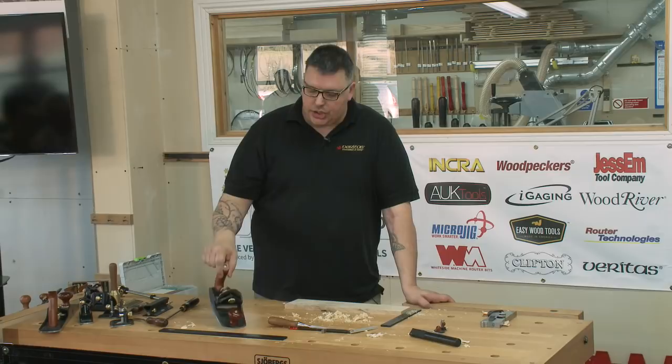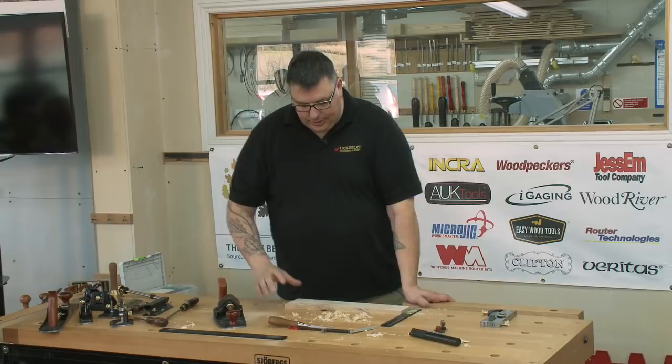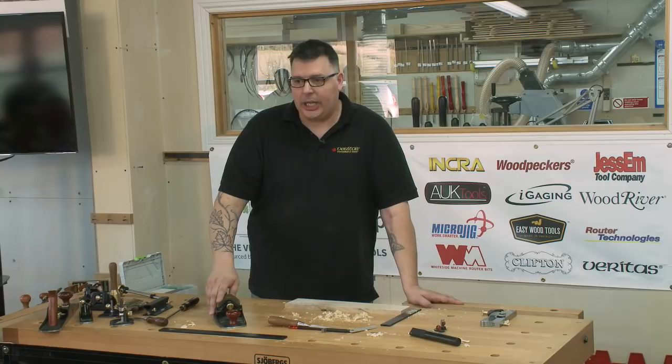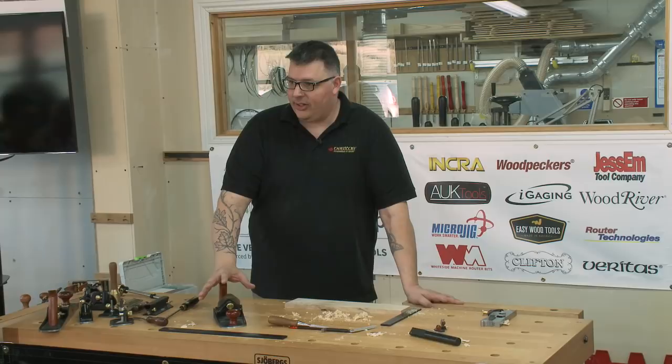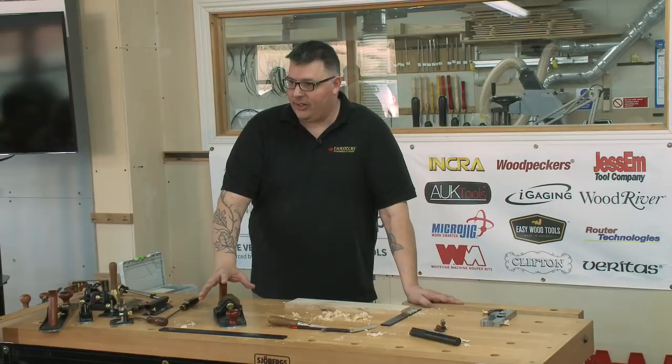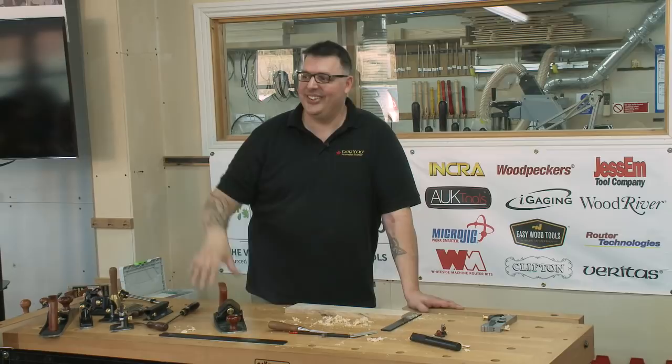This is a big plane, so it makes a lot of sense for large drawer fronts. We also have a smaller scraper better suited for inlay work. The beauty of the plane is that it allows you to maintain a good cut and maintain flatness. If you work an area too much with a card scraper and hold it up to the light, you'll see low spots — and when you add finish, they stare right at you.